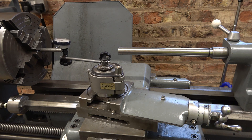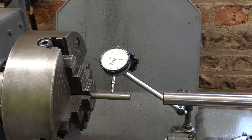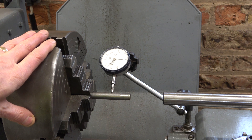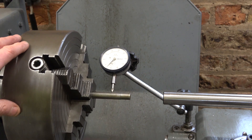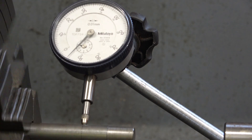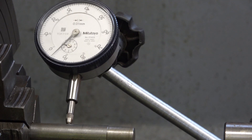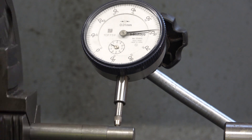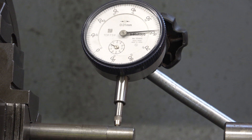It's not very nice really. I set up the clock on this bar and spun the chuck and it seemed to be out, but then I thought hang on — I'm clamping onto here, not here. Now that looks pretty good. But if I move to here — look at that. Or if I move back to here — look at that. And then because I've machined a reduction on there, look at that. So this is how I make my mistakes, schoolboy errors. Now I'm going to re-set it up to clock it properly and then we'll try again.